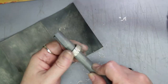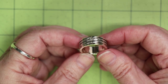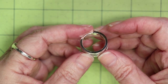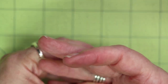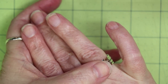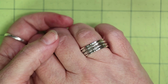Once you have finished all of the sanding, your ring is ready to polish and add a patina if you want. If you have a texture, adding a patina will make the details in that texture really pop. Here's how the ring looks after cleaning it up in an ammonia soap solution and a jeweler's brass brush, after polishing, and then adding a patina. I provide the recipe for the ammonia solution in the details section below. I hope you give this style a try — it is fun and a bit challenging, but it gives you a different twist on your typical spinner ring. If you enjoyed this video, please give it a thumbs up and be sure to subscribe to see future videos. Thank you for joining.